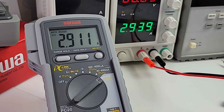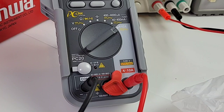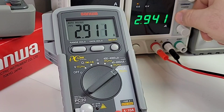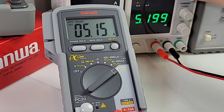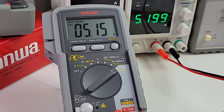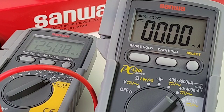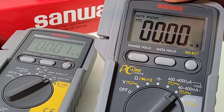Taking a quick look at current: sitting at 2.9 amps in high-current mode — no worries there. The safety cover swivels and you insert the positive input into the current jack. Taking it up to 5.1 amps — looks good. However, on the milliamp side the CD732 reads 250 milliamps while we're getting nothing on the PC20 — I've probably blown the fuse, and verifying that confirms it: the milliamp fuse is blown.